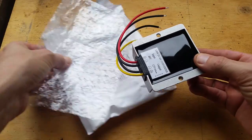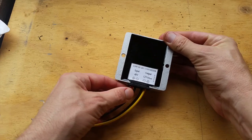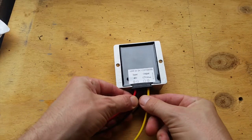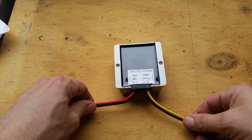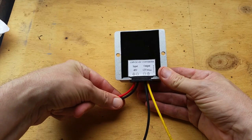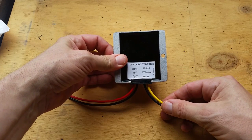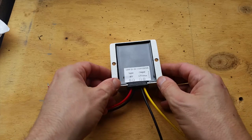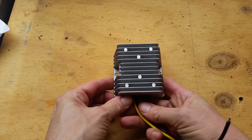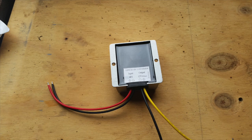With the lights misbehaving, I ordered a 48V to 12V converter and thought I'd run the lights off the main battery bank. I ordered one from Hong Kong and it duly arrived. These two lines are the 48V input and these two lines are the 12V regulated output. And if we turn it over you've got a nice heat sink. The label on my converter says it can handle 10 amps, which should be heaps for my LED lighting.